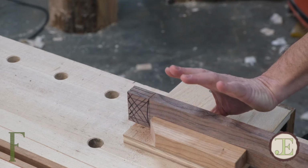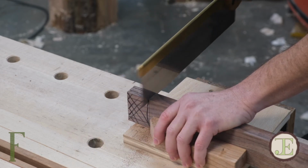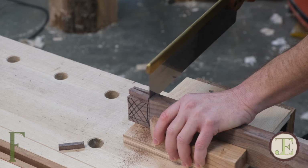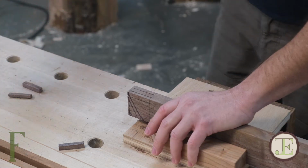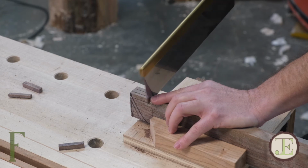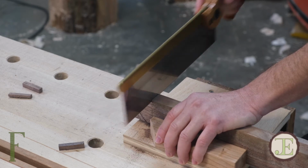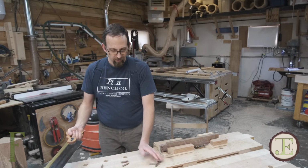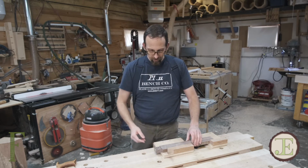You've got to make sure you get good pressure on the bottom of the board. It'll rotate like it did to me there. Okay, so that's the first cut. Flip it over, make another cut. You can hear the pitch change. The scrap is vibrating, the offcuts are vibrating, and the saw plate is vibrating, and the pitch will change.